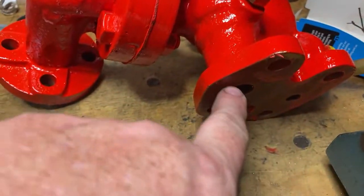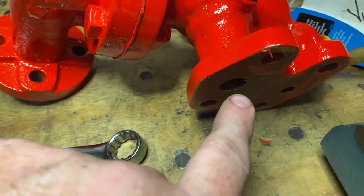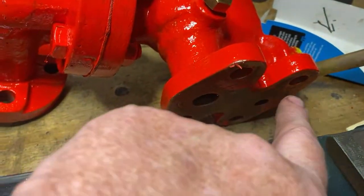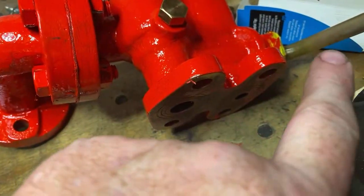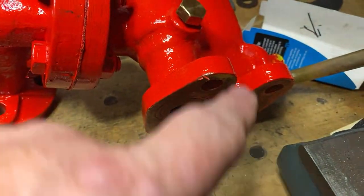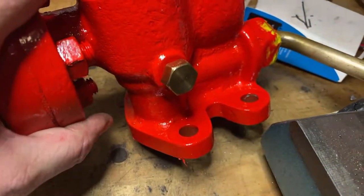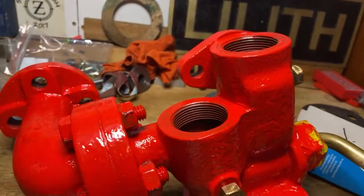Delivery into the pump, bypass. So suction is the word I'm looking for. Suction, bypass. So when that valve in the middle is open, it's got masking tape around the end at the moment, but when that valve's open, this pumps straight out of there, back here, doesn't lift the pressure valve, this pumps straight back down into the tank, so it circulates. When you close that, it can't come back down and take the easy way out. So it comes out this one, which is the delivery to the boiler. So that's how that works.